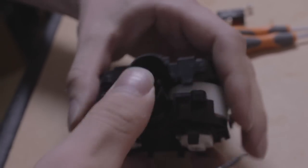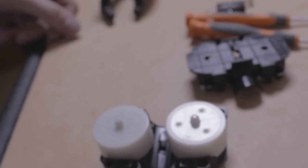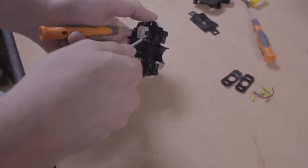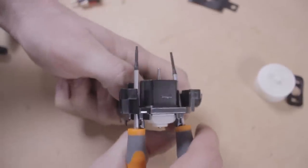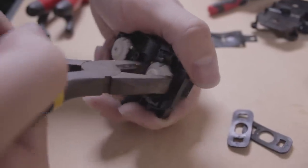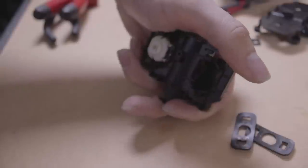Removing the flywheels is actually quite easy. Take two fine screwdrivers and slot them through the holes in the cage. Press down on the cage and the screwdrivers should push off the flywheels. Finally, remove the motors with a pair of pliers. Alternatively, you can press them out via the shaft — this may break the motor though, so don't do this if you want to keep the motors.